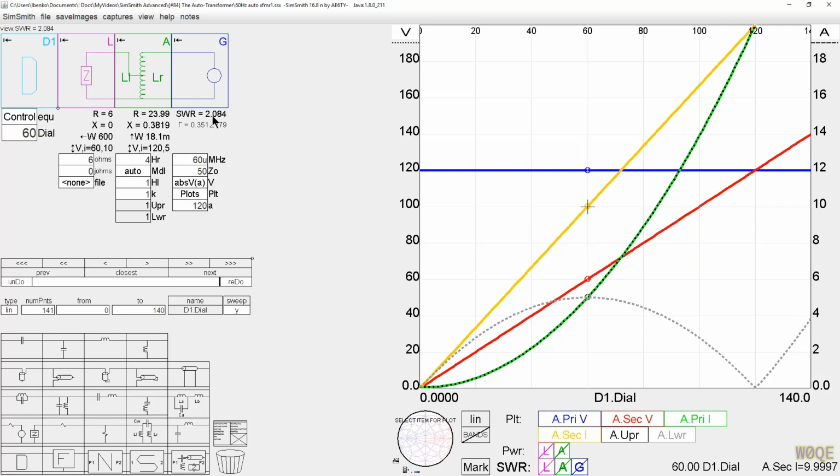To respond to the poor person who made the comment on the forum, people were giving him all kinds of things, saying put the fuse in the tap. Well, if you put the fuse in the tap, then putting the fuse in the tap is by definition putting it in secondary. So we're only looking at the orange trace. And is that right or is that wrong? Well, it's not right when you run this up at 100 as a step-up transformer.